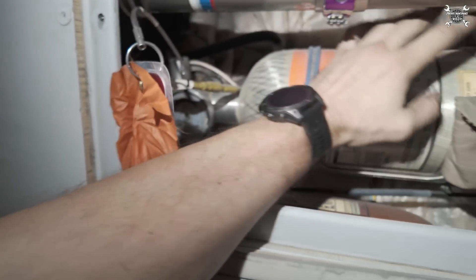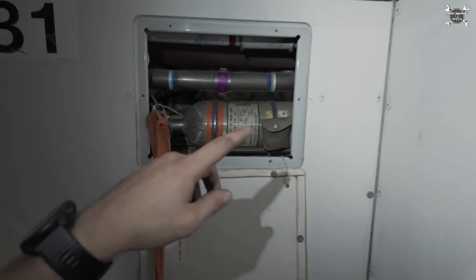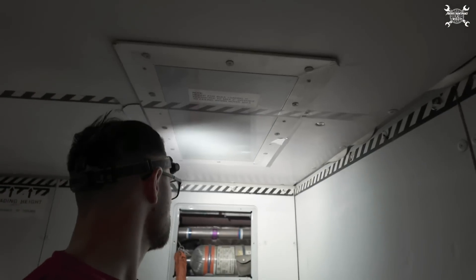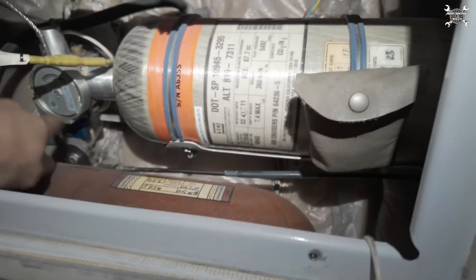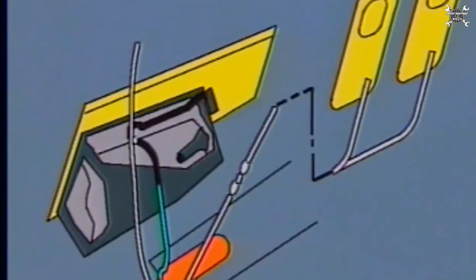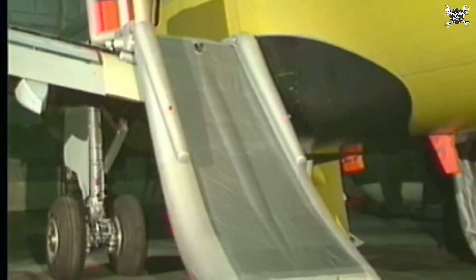Here's how it actually works: the bottle is filled with nitrogen, and whenever you open the emergency exit which is over the wings, you pull the lever, which — thanks to a cable inside — will open the bottle, and that will release pressure inside the slide and inflate it. So this way the slide is secured and we can safely work on it.